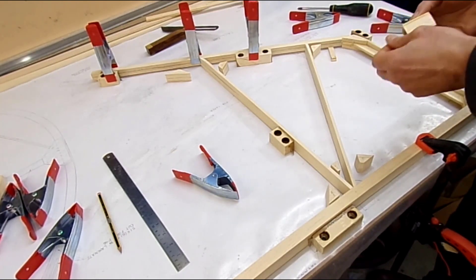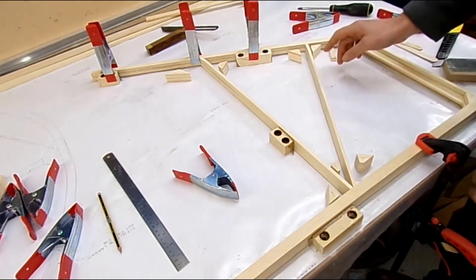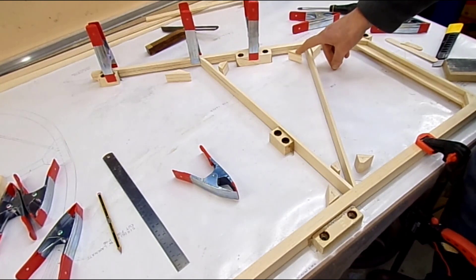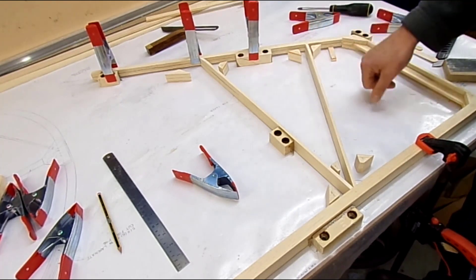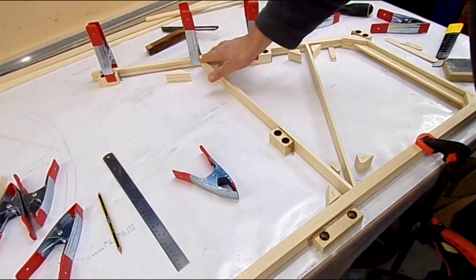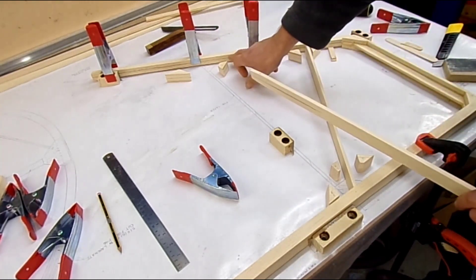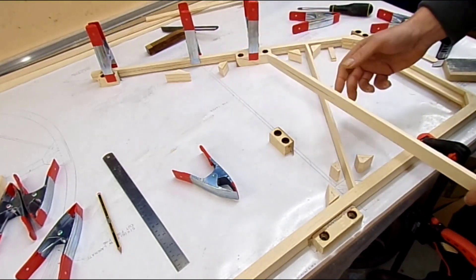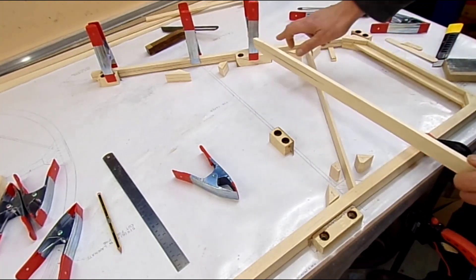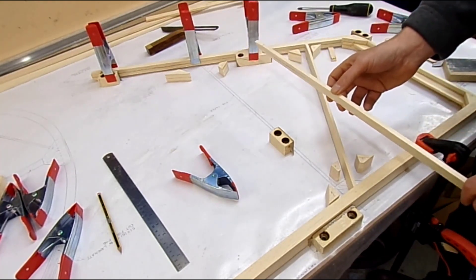It was just wide enough with the wand but I prefer to have a little extra. So I've redrawn the centre lines, they're all marked up, I put letters on. The annoying factor is the two here are not at 90 degrees so I had to make them individually. When you first look at it you think it would be a 90 degree joint but it isn't. So already I've got all the ribs cut with their appropriate tapers, marked up with the centre lines. The leading edge has been set up so the centre lines on the ribs match up with the centre line on there, so that's at the correct height, and it's clamped to the block so it will stay where it is.